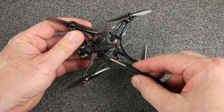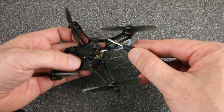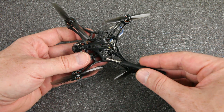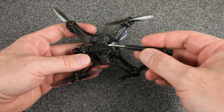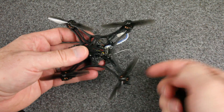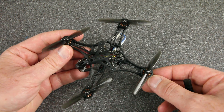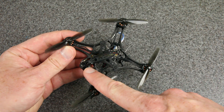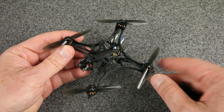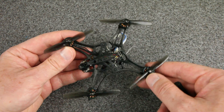Here's a quick build tip: when you open it up, take out the three screws to install the canopy — it comes with all the screws and grommets it needs. My suggestion is to take the canopy off and immediately put those three screws back in place to hold the grommets, then flex the frame a little to pop the flight controller in. Otherwise the grommets keep popping out, which is a pain. If you're transplanting parts from another drone like I did, it's a quick build, but one gotcha is that the camera is pretty far forward. In my case the wires weren't long enough, so I had to solder extensions on. You might be able to flip the flight controller around with USB and power in front for a shorter path.